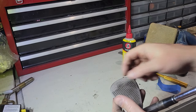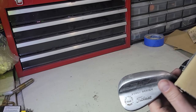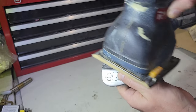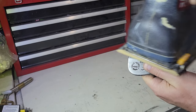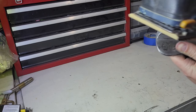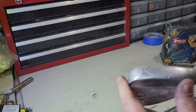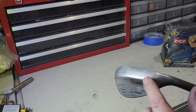Now that I have it cleaned out, we're going to go on to the polishing step. I'm going back to 220 grit and we'll see how we get that. So we're going to go to 220 now and work through this — same kind of method. Now at this stage I go through it and look, and I can see some nicks and dings. This gives me a better picture of where I need to go back over with the 110. I'll do this initially over the whole thing, and then go back and clean up specific spots.